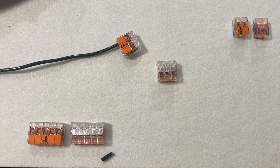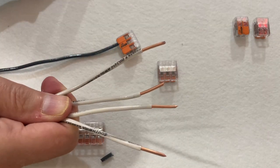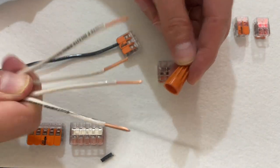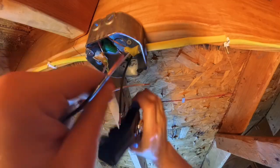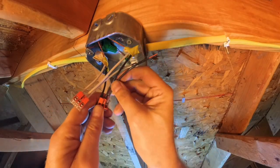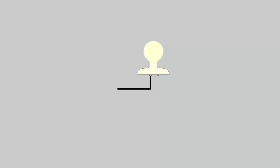I was thinking ahead and knew the junction box would have to connect at least 4 wires at a time. The traditional way is not only difficult to twist all those wires, then it'll be stiff and difficult to bend into place. And do 4 12-gauge wires use the same wire nut as 2 12-gauge wires? I don't even know. Now the load wires are cut to size, stripped, and connected together along with the 3rd wire. Here's a breakdown of this connection.